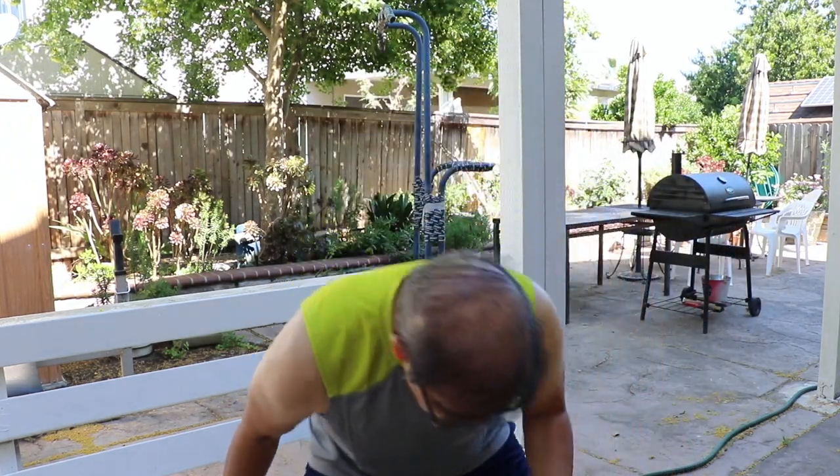Good morning. About two weeks ago, I published a blog on how to do concrete work out in the front yard. And I gotta be honest with you guys, it was a total fail. I never used Quikrete as a mortar because it's just gonna crumble, especially the way I did it. I used the sand first and then I put a wet cement mix on top of it, so it crumbled.